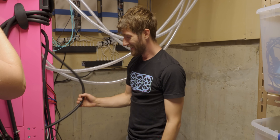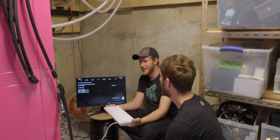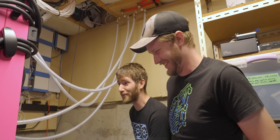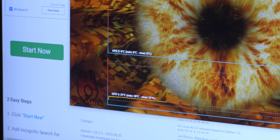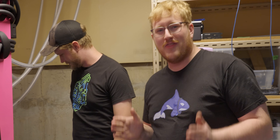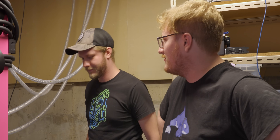It's alive! We've got Furmark loaded up and we are at 37 degrees on the GPU — under load! It's running 350 watts right now and it does not care. This is a 7900 XTX. The pool system works! 37 degrees — it's flat, it doesn't move, it's rock solid. It's nice when you have an effectively infinite amount of heatsink.